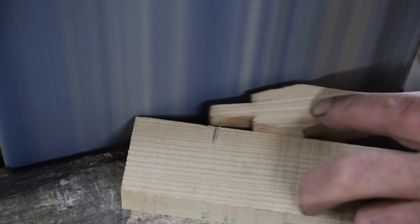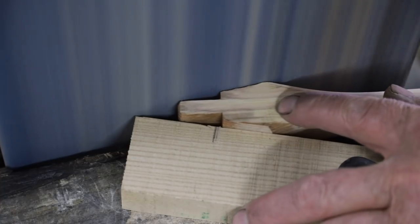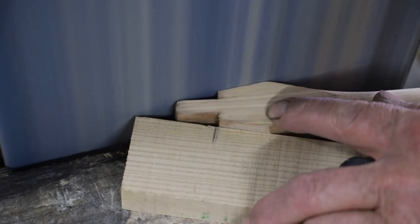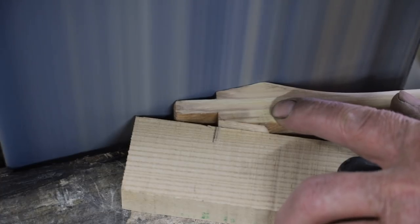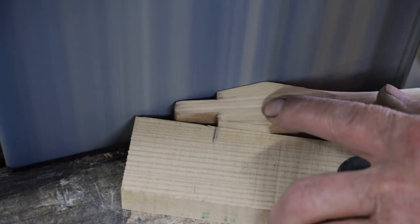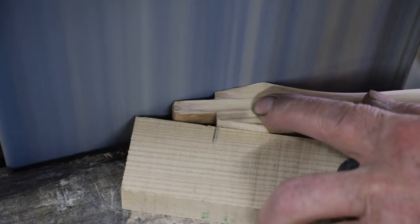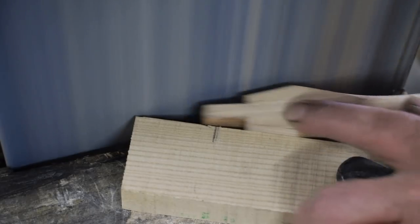Now these smaller Sarven spokes generally come in 1/8 inch increments. And as I stated before, these are 1 1/4 inch Sarven spokes. But they really never fit. These shoulders are at 22.5 degrees, but as they come, they're usually kind of rough. So I do finish sand them.